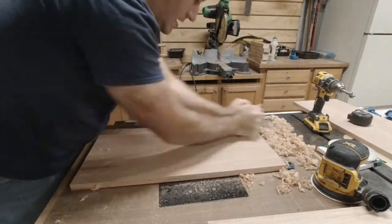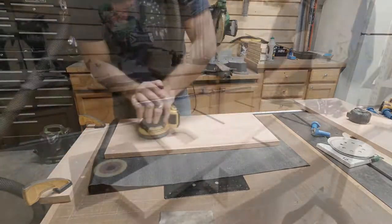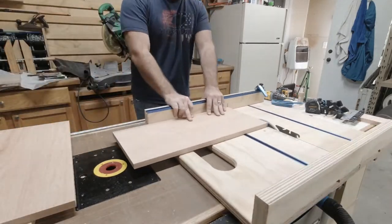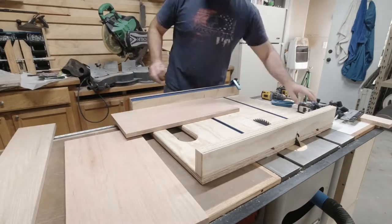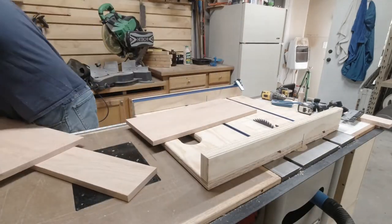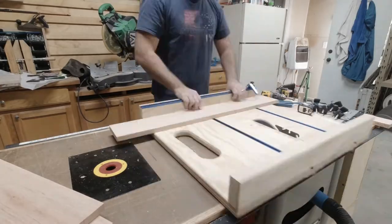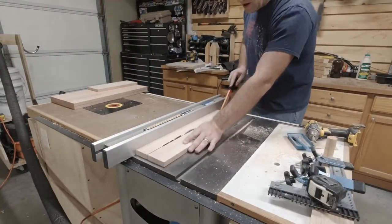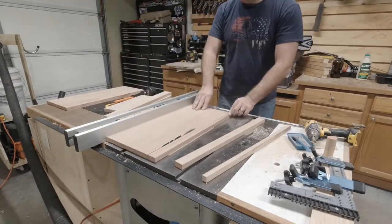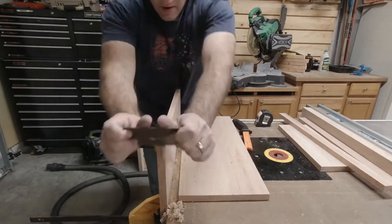After it dries, pull the boards out. I'm using a card scraper to eliminate any seams, then sanding afterwards for a smooth, perfect finish. Then we move on to cutting them to their final length. I shave one end off using my crosscut sled before measuring to the final length and cutting it. I like the crosscut sled for this — it's more accurate than the miter saw even when the miter saw is tuned up really well. Nothing beats a good crosscut sled. After that, it's time to rip them to final width. I use the card scraper again to get rid of burn marks from the table saw blade — probably need to clean or replace that blade.